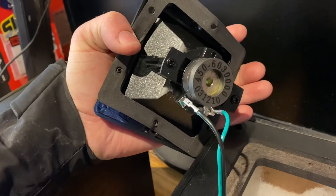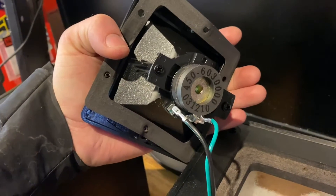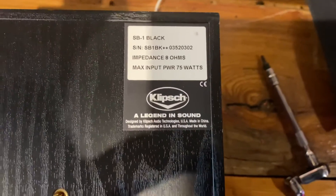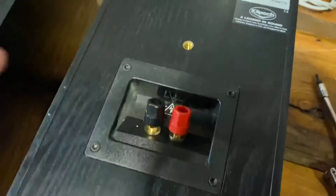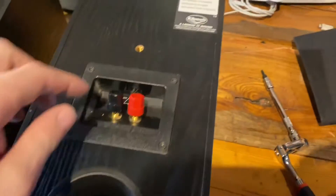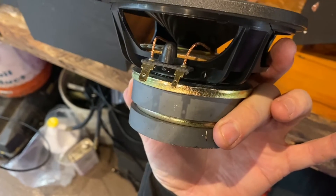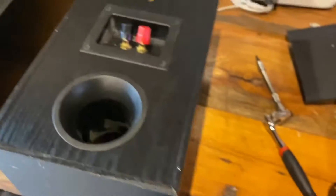Nothing wrong with the tweeters, just for the sake of being thorough. The full part number is 450-603-0000-03-1210 — so there we have the actual part number of the speaker. It's an SB1 black. The other pair I have doesn't have these little tripod screws in — I'm guessing that's for wall mounting. These do feel like a newer, more cost-cut lower-end version. It does look like there's gold-plated terminals on not only the binding posts here, but also on the speaker voice coil driver as well. So there are aspects of this I actually quite like.